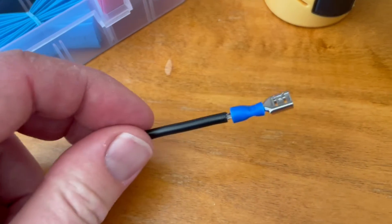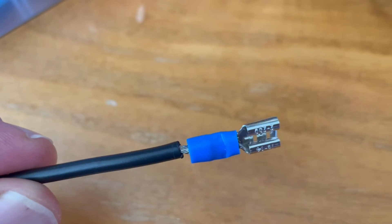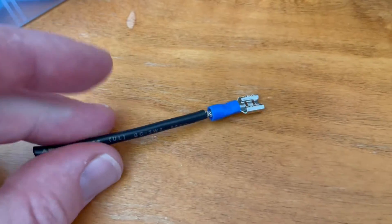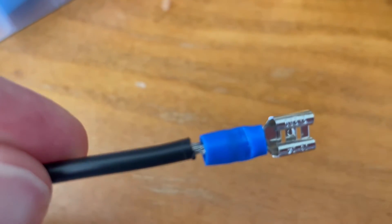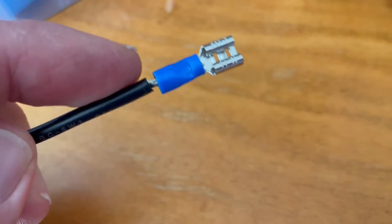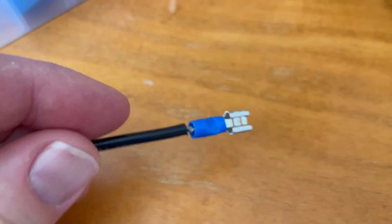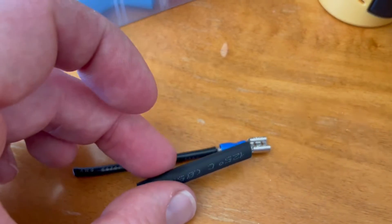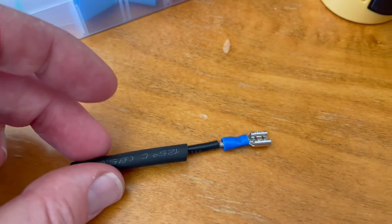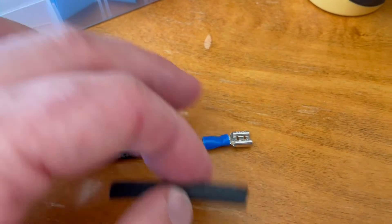So here is an example of something you may encounter in one of your electrical projects. We've made this connection with a tip of a wire here, as an example. As you can see, we've left a little bit too much on the underside of this wire tubing here, allowing there to be some exposure. So this shrink tubing provides a great opportunity — I'm going to pick something that's just a little bit larger here to cover up that area. We want something that can actually fit this tubing as well as go on to this top shielding over here for our connector.